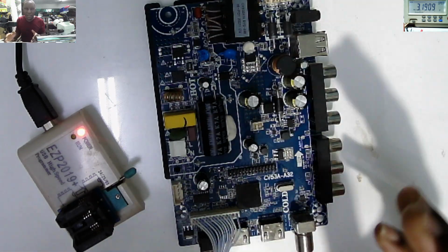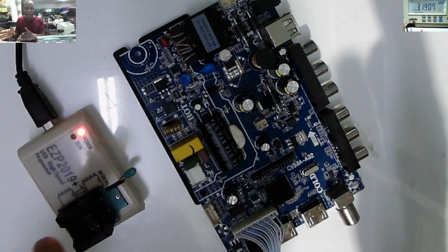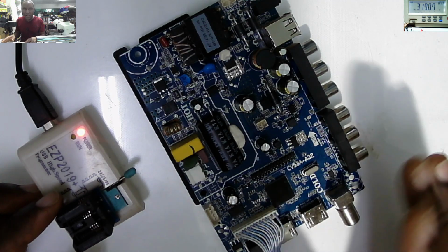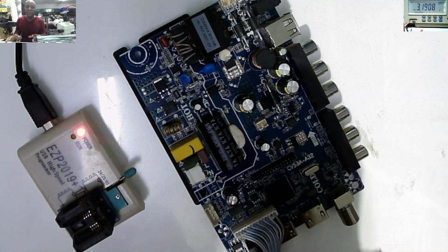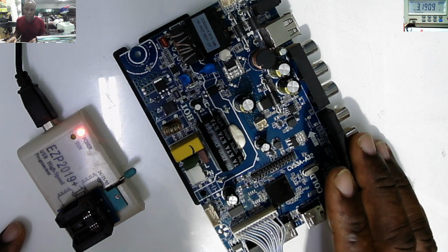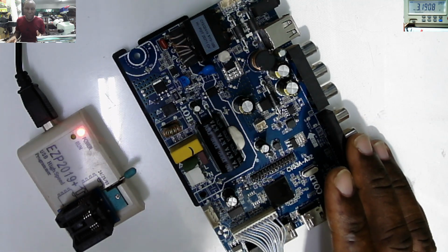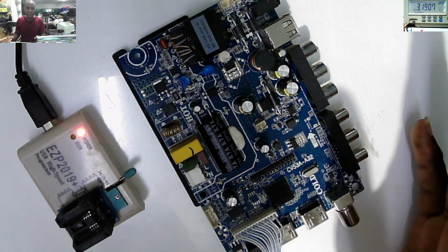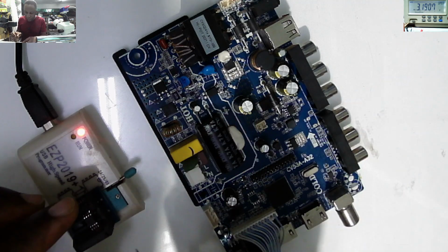You know, there are so many types of BIOS chip. We have BIOS especially on laptop motherboards. I found BIOS for the PCH and another BIOS for the EC chip. So don't get confused there. These BIOS chips look alike, but they have different firmware. So if you load the BIOS chip for the PCH and you put a firmware for the EC chip, definitely it won't work.